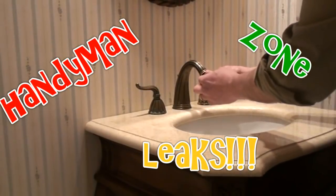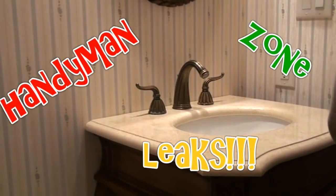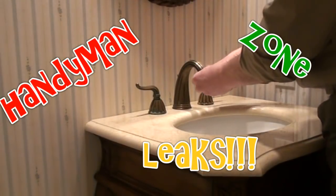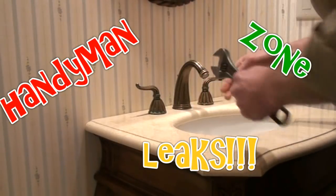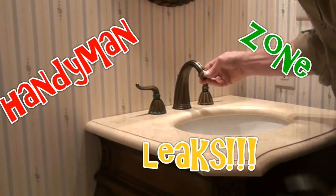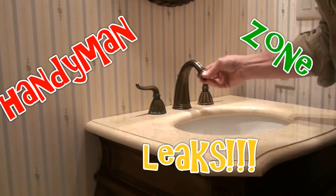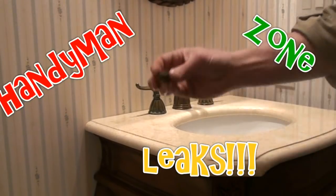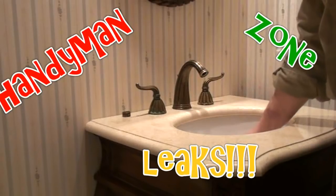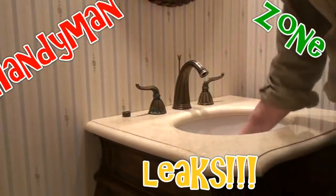The first thing we're going to do is take the aerator out, because later when we turn the water back on, any debris in the pipes will get stuck in the aerator and make the water squirt out crooked — the little screen will get clogged and make more work for us. Carefully I'm going to take the aerator out and set it aside. The next very important thing is to close the drain or put a rag over it so no small parts fall down.